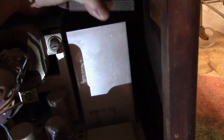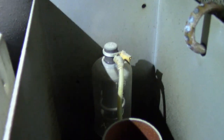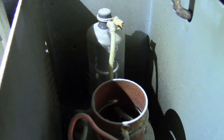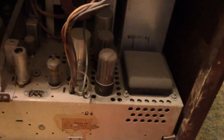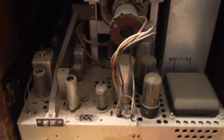Let's take a peek in here. It's not even attached — or it is attached, but just by a little wire. I'll have to review the film afterwards. You're expecting a flyback — there's no conventional flyback in this set. That's again why I like these early sets; you see something a little different. But it does use the standard 10BP4 picture tube, so let's test that out. I have plenty of spares, so this will get restored — that is a certainty.